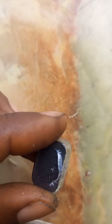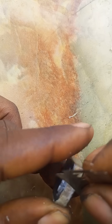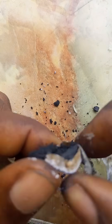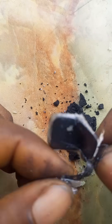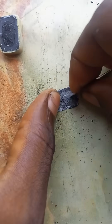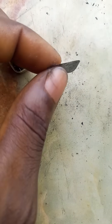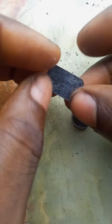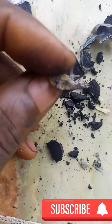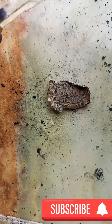Let's examine a single cell. The black substance is a mixture of manganese oxide and carbon, and it serves as the cathode. Beneath it is a zinc plate, which serves as the anode — as you can see, it doesn't magnetize. Both are separated by a brown paper soaked in electrolytes such as zinc or ammonium chloride to facilitate ionic conduction, like the typical Daniel cell.